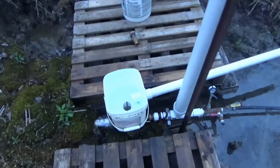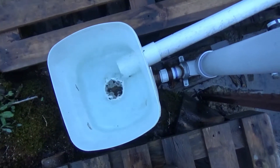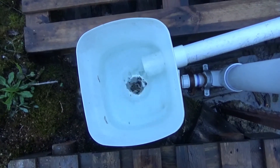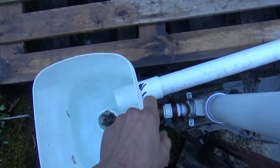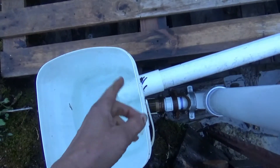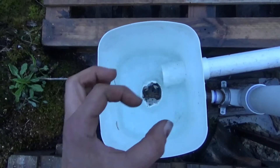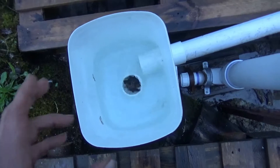April 29th, 2018. I've gone ahead and made some nice seals on this so we don't have any leaks, so we can capture all the water that the ram pump is waste-gating. This is two-inch pipe coming out — basically just took two two-inch couplings and a short piece of two-inch pipe crammed together, silicon-sealed both sides with aquarium sealant. In here, this is another two-inch coupling that snaps over the other two-inch coupling and two-inch PVC pipe, and there's a rubber o-ring gasket that goes under the bucket for a nice seal.